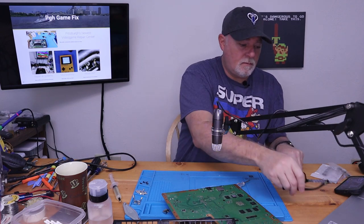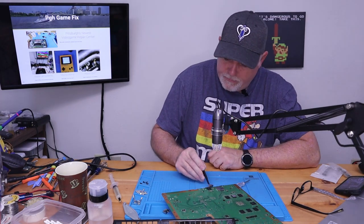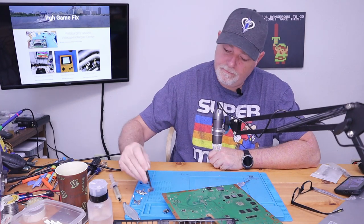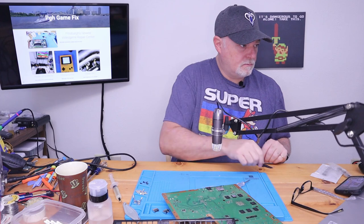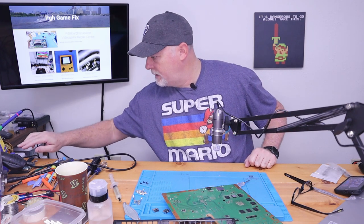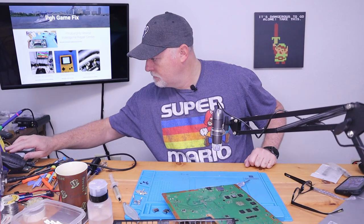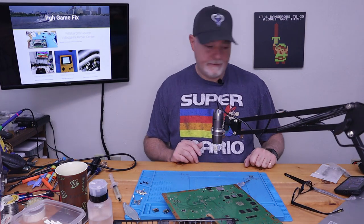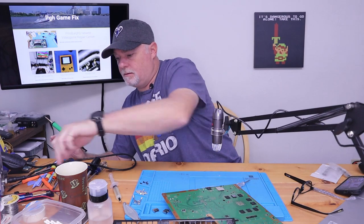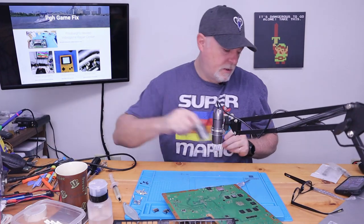Like I was saying, these PS5 boards, you really do not want to force. If this does not fall out on its own, you can damage it very, very easily. All right. So now we can turn the heat down on our soldering iron a little bit. And we will get some desoldering braid and some good leaded solder.